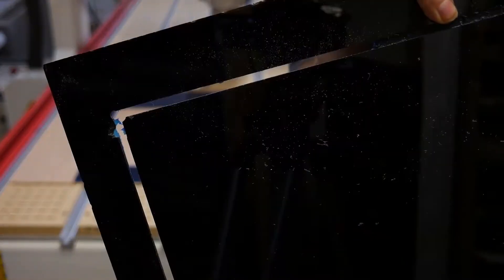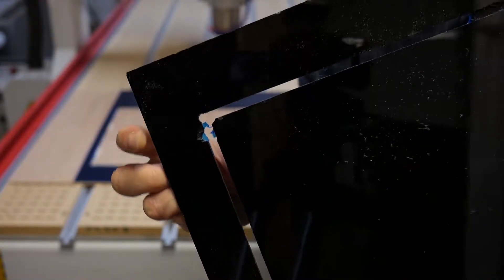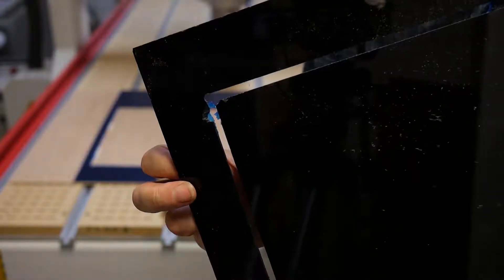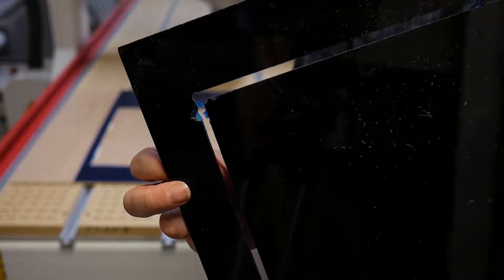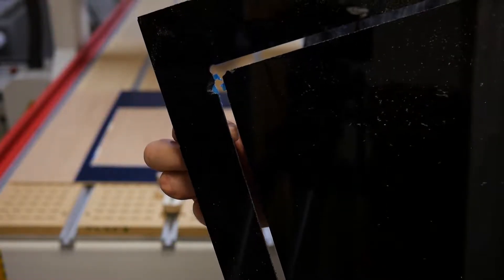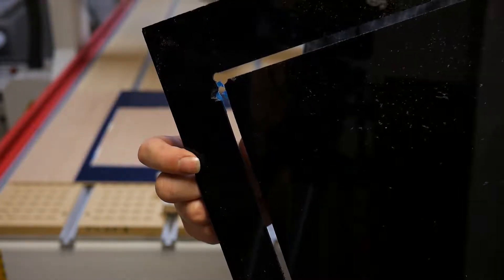Take a look at this corner - you can see it's chewed up pretty badly. This came off the clamp setup behind us. The edges lifted as the tool crossed an area without enough support, and as soon as that happened, the angle of the material caused deep gouges to be cut out. You're going to get a really chipped-up, nasty-looking edge. That's what we want to avoid.